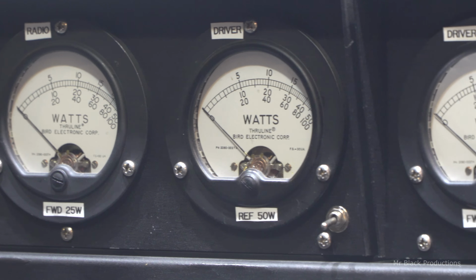Now, the next question everybody's going to ask is, why didn't you run like 4-aught? It's not necessary. You can run 4-aught cable. I'm not saying we couldn't have, but there's no point. The biggest alternator that we can get to go to your stock pad mount location is that little 350-amp alternator, but it's continuous.